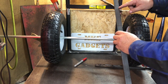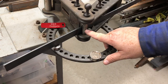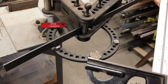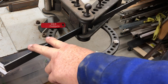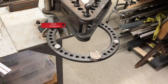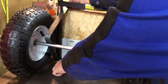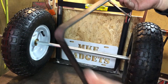If this part is too long after I bend it I can always cut a little bit off, but it's harder to weld more on. Let's go over to the bender. With my layout line behind this pin I took my combination square — it comes in at 9 inches. I want to make two of these so I want to be able to repeat the process. I have a stop here so I don't overswing my angle. So after bending and checking and bending and checking, I'm pretty close. Not bad for my first try.